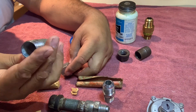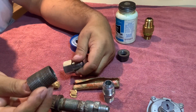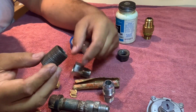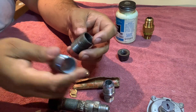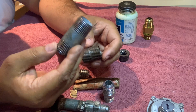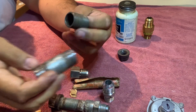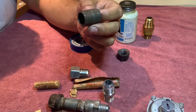If you've got three-quarter pipe, here we go — black pipe. That's how you can tell the difference between a gas pipe and a water pipe. Extra credit: water pipe is normally galvanized, and gas is normally black pipe. So you want to look for the black pipe.